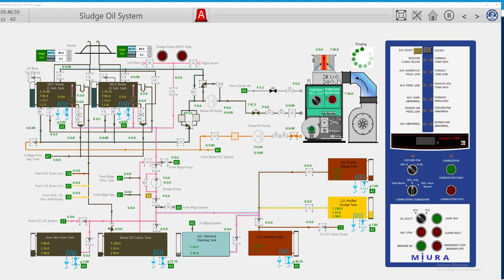Today we will burn from the waste oil settling tank. In the IOPP manual we can get all the specifications — the quantity, capacity, frame location, proper name — and everything will later be filled in on our oil record book. It's really important that whatever handling is done from the tanks stated in the IOPP, because we cannot add tanks on the oil record book that are not included in the IOPP certificate.